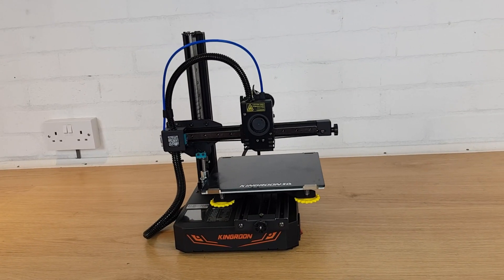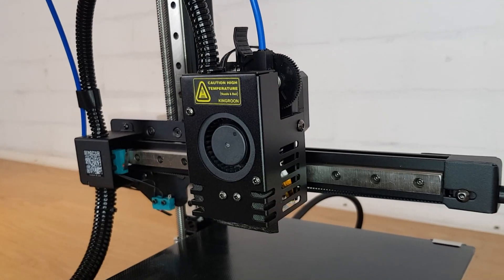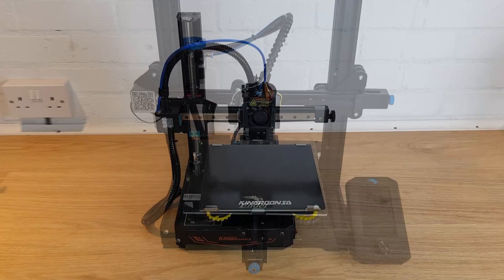The main reason I was interested in reviewing this model is that it's cheap — and what I mean by that is that on paper you get a lot for your money. It has a Titan-style direct drive extruder, super accurate linear rails, a touchscreen, and a print volume that rivals most Ender 3s and their clones but with a footprint that's around 45% smaller. All of this comes at a price of around $200 before the discount. If it does all that it promises then this could become the new king of the beginner 3D printers — as you'll see though, unfortunately it's not quite that simple.